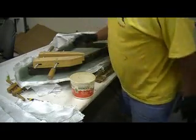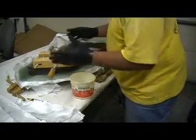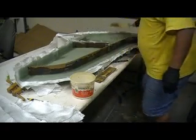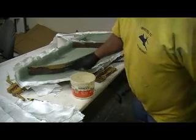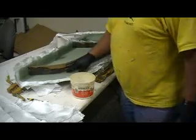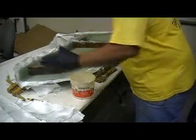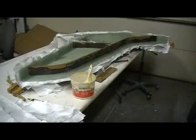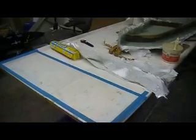I got my cardboard on there — see what I did? It's getting kind of sticky now. This is building up a lot of heat. Resin's drying faster. So I put that cardboard on there, bend it to where I want it, put a little weight on it. Then I come in the bottom half and just kind of put a little cloth on there in that corner, leading that onto this flange, just kind of glass it out in place. Let it set up for a little bit — it'll stay without that weight. It's not completely set up, but that mold's hot. You can feel the heat coming off of it. She's setting up fast.